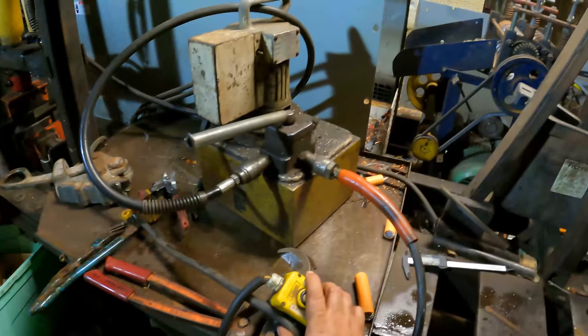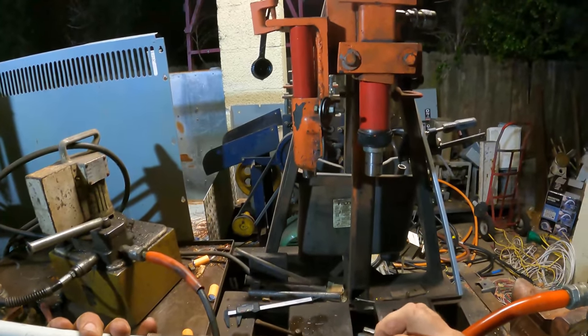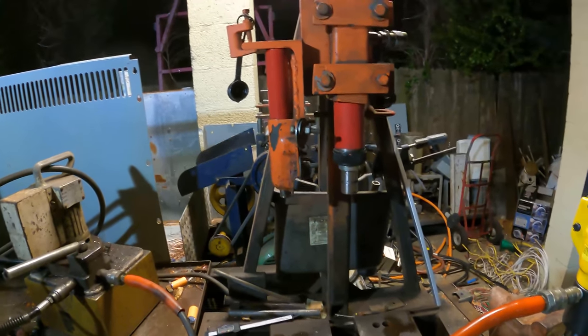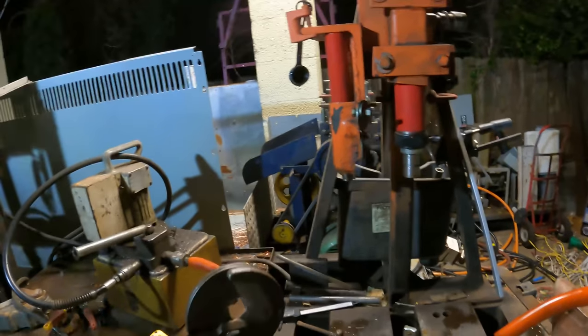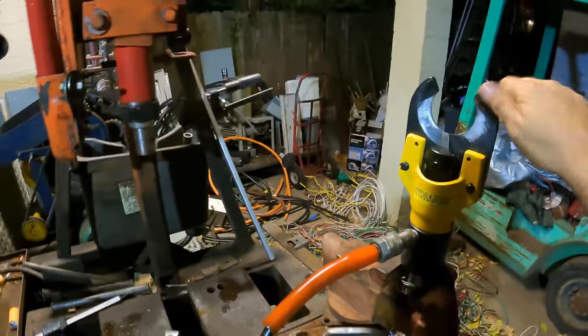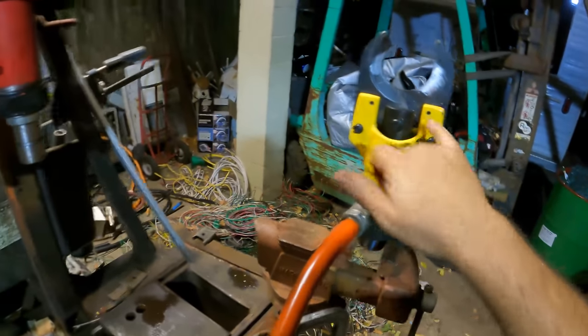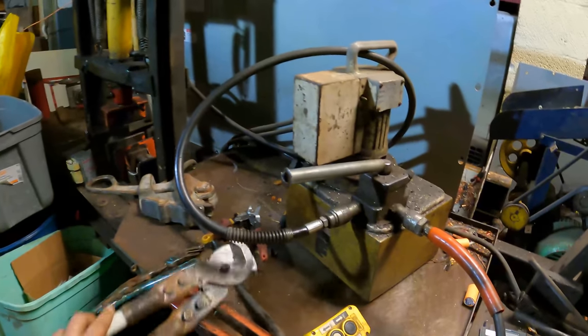So this is basically the same concept of why, if you can see this, this actually has a lock nut, a little Allen key lock nut to keep this tight, because otherwise that would happen. We're gonna replace those roll pins. That's just a hollow roll pin. We're gonna go ahead and send a solid pin through that.